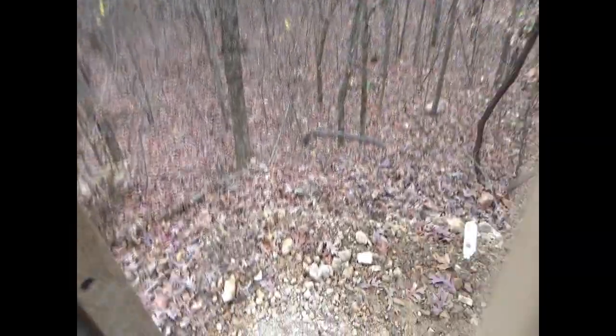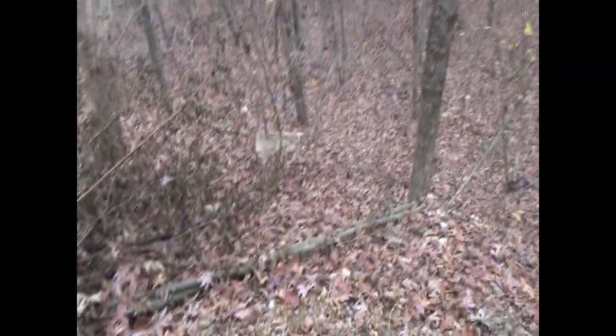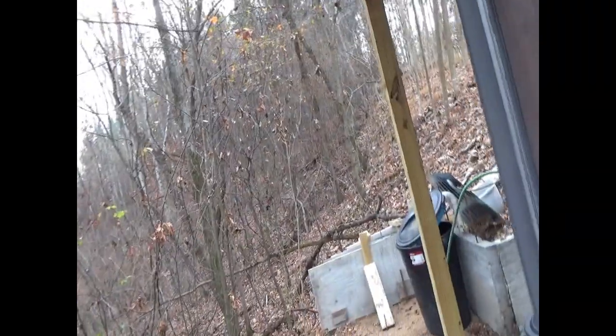Nice and dry on the roof. I'm gonna caulk the seams on the roof. Sometimes some little things. So this is 10 by 10, so it's just barely got an overlap, so you can see some light. So I'm gonna go ahead and caulk those. With the warehouse garage, that's 19 by 29, so it gives me another 6 inches. That gives me a foot to play with, rather than being exact. When it's exact, you can't do a double corrugated overlap.